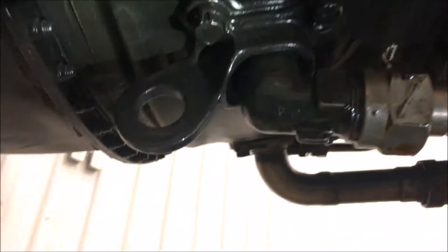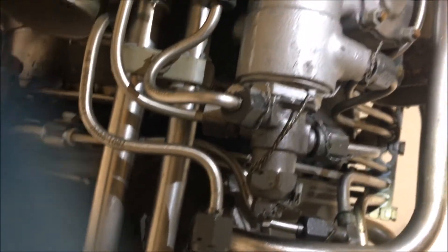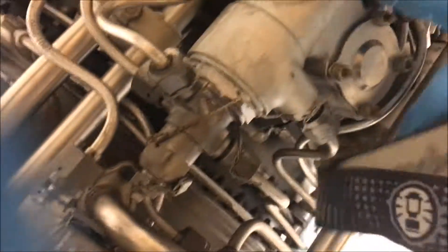Oil supply line and return all looks good. Cannon plugs are all good. Looks really good. I don't see any chip detectors down here to check. Bottom of the paint on the flow divider is not even scratched. Igniter box is all in good shape. There's a bit of oil drips on the bottom of the oil pump. There's that red piece there — I'm going to assume that's an airframe-supplied sensor, I believe for the compressor discharge pressure, or oil pressure, I'm not sure.